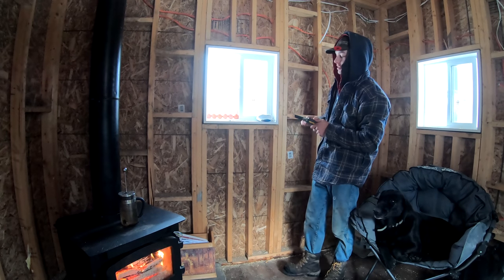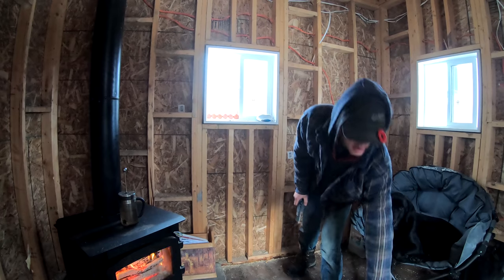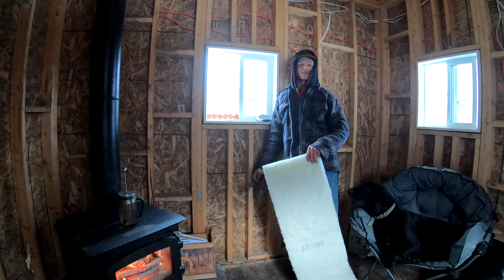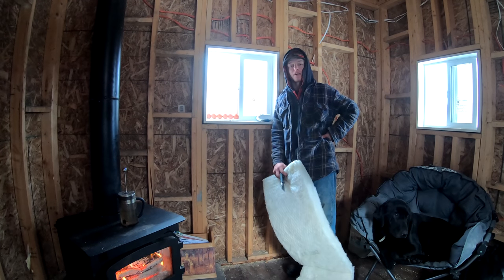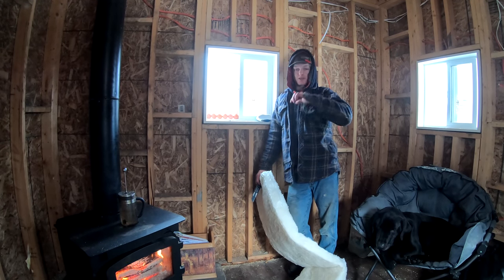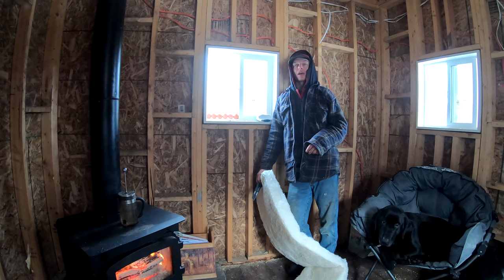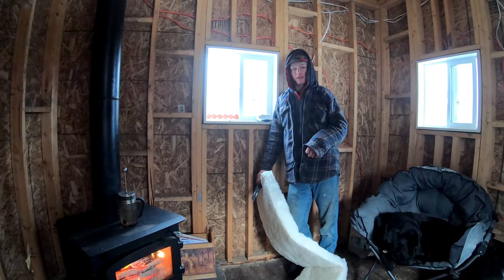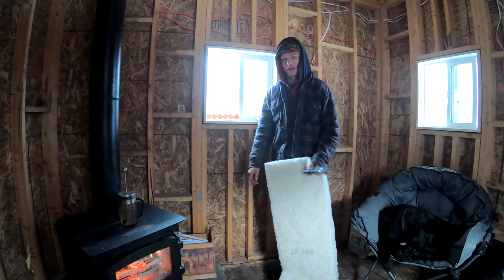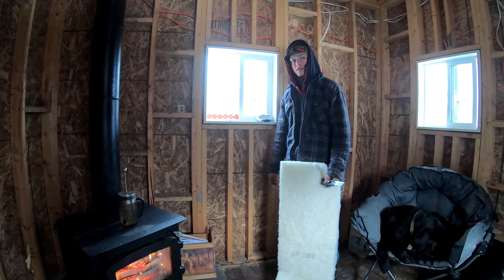Just getting my lower level insulated. When you look at my window and door frame it's a little unorthodox, to say the least. When I started this build I had a very basic understanding of framing and carpentry. I didn't do my research, didn't do any planning — I just wanted to live in the bush. I put a video on my framing and a lot of guys said it wasn't quite right. So I came back and added a shitload of these horizontal pieces to gain stability — they serve as little headers.